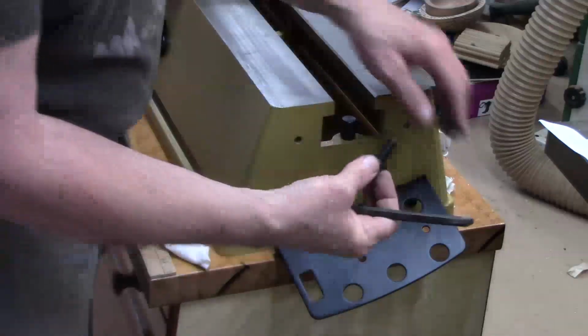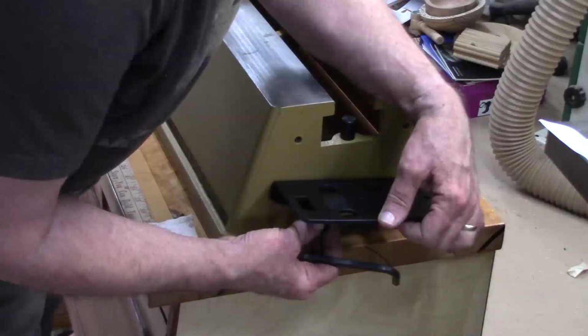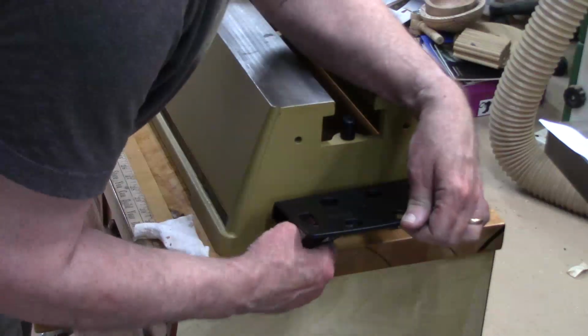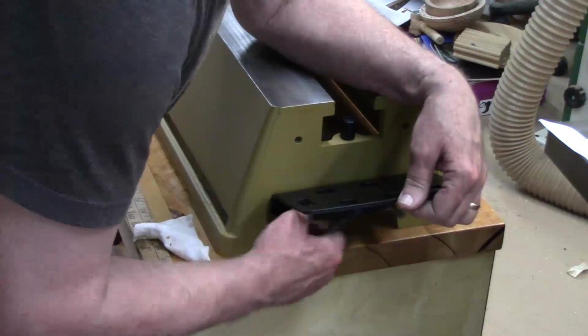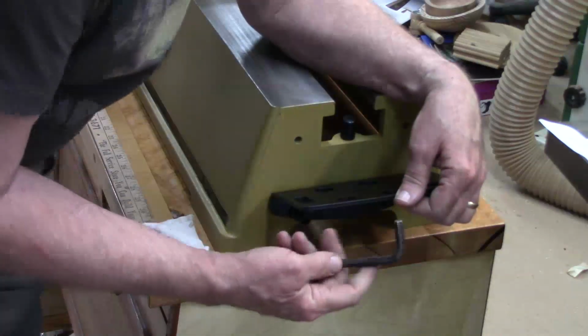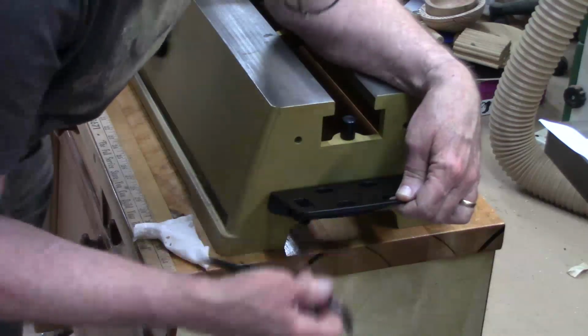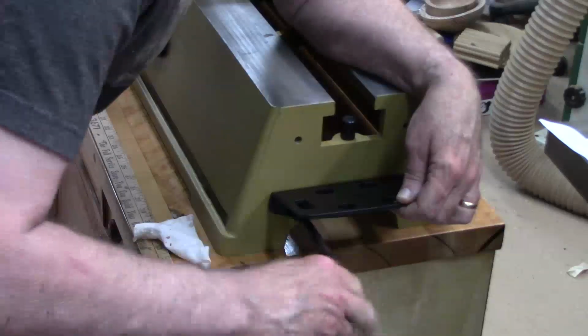The tool holder comes with these two large shoulder bolts that mount on the lower holes of the lathe bed. It does not come with an Allen wrench to push these things in. It uses an 8mm, the same size to mount the legs on the larger one, and possibly the legs for the leg stand that's an accessory for this.